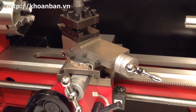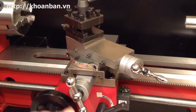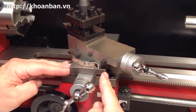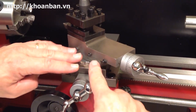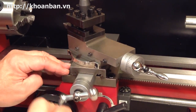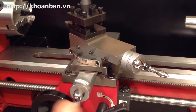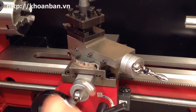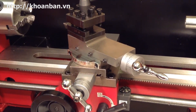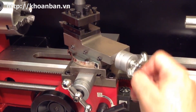Let's move in a little closer and look at this assembly. This whole unit together is referred to as the carriage, and it moves back and forth on the ways. This part here forms the base of a stack of three things: the cross slide, then on top of that the compound slide, and on top of that the tool post. The cross slide moves perpendicular back and forth across the ways and is used to advance the cutting tool into the work — for example, to reduce the diameter of a workpiece. The compound is used typically for cutting angled work such as a taper or bevel.